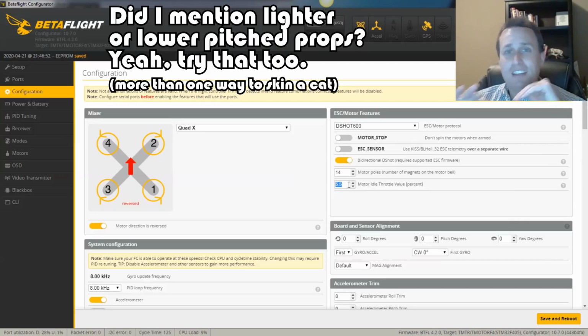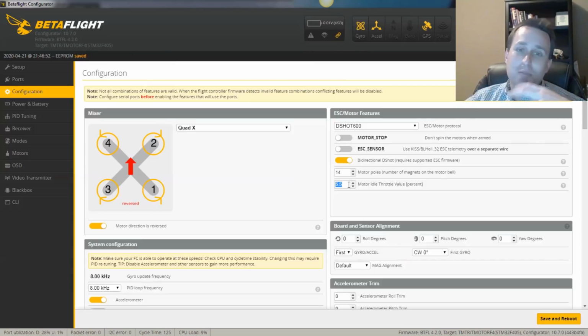You're going to get less hang time inverted. I don't know how many of those moves you're doing, but if you're doing a ton, you will get a little bit less hang time. See if you dislike that versus the increased performance in prop wash. Obviously, your motors not going down as low in RPM when you're at 0 stick means that they don't have to rev up as much to combat prop wash, which you'll see. It generally helps quite a bit. So check out those two things.